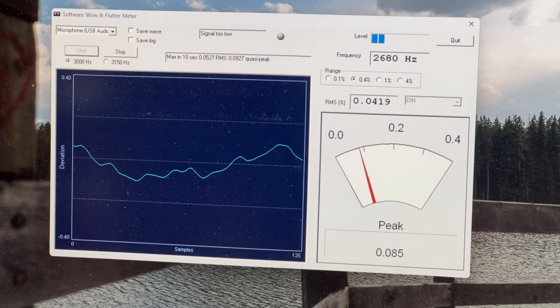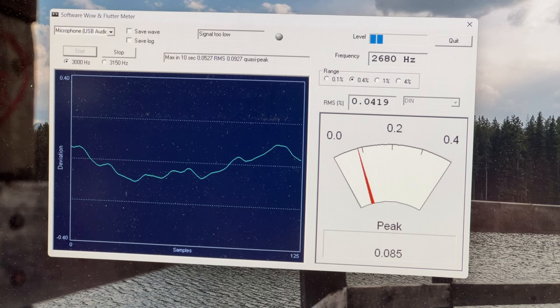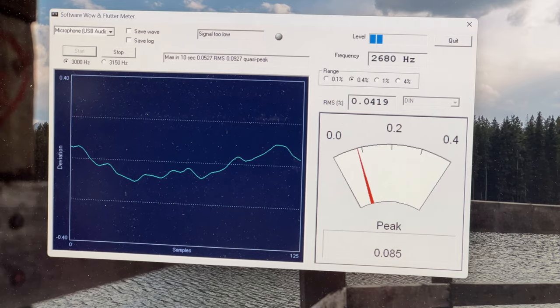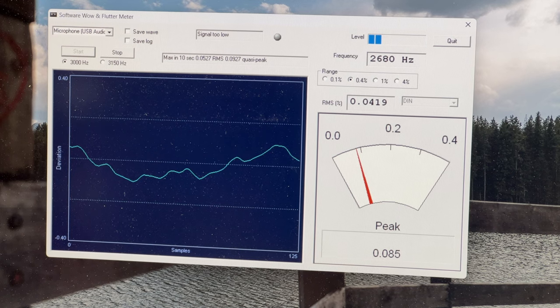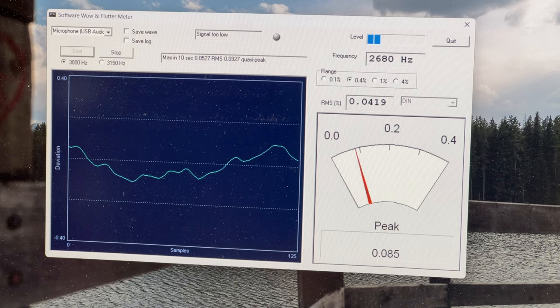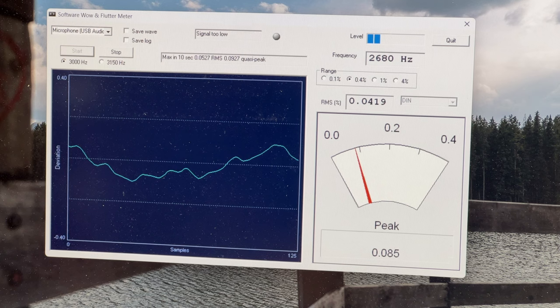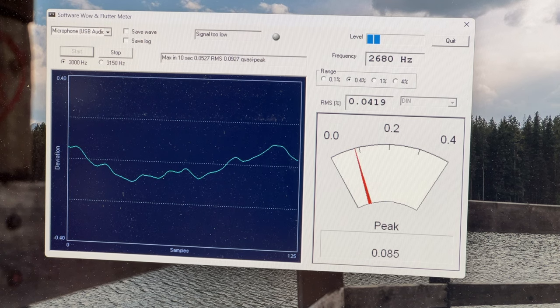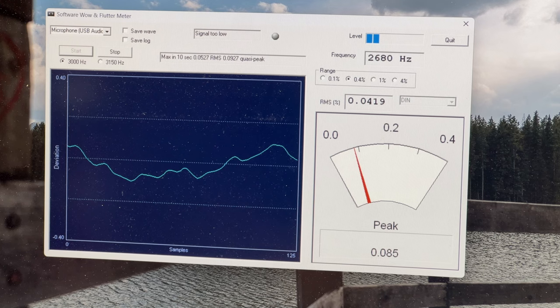And I'm going to go with the other 3 kilohertz tape, the one from the RS-B755. That one gave me 0.029% with this deck before service. And I'll warn you now, it's probably not going to be much different because the Technics runs at about 0.029% or something like that. This deck should be outperforming that deck for wow and flutter, but we won't know that until I go in with video number 3 and do a 3 kilohertz tape on this machine and then start comparing it with my other machines. And we won't really know for sure until the DD7 is fixed, because it's the other one with this transport. Okay, let's see where this tape gets us.